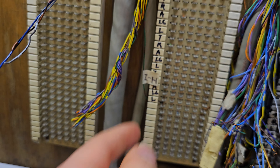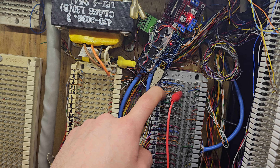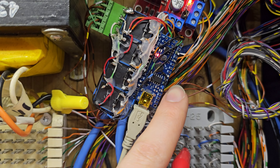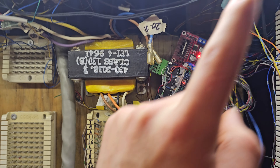Since my lamp power supply is DC, I actually have positive 9-volt DC as my lamp power. So the wire that is connected to my lamp leads is positive, and negative is connected to ground. This is the same ground as my whole key system, so it's actually negative ground, which I know is opposite of what normal telephone stuff is. But since Arduino operates better with negative ground, that was necessary to have that be negative ground.